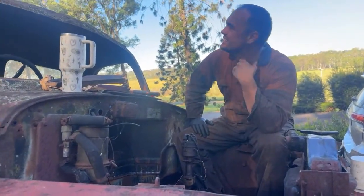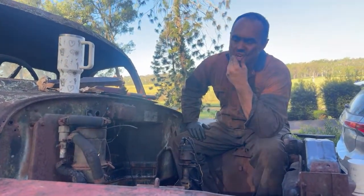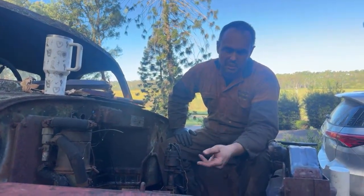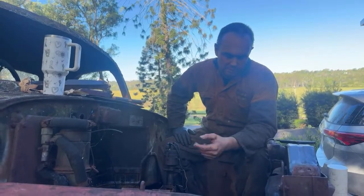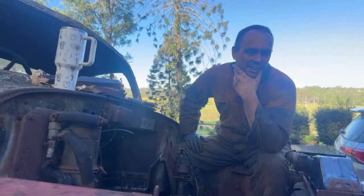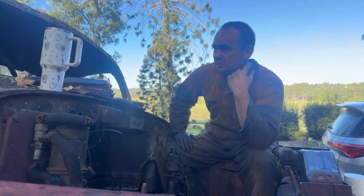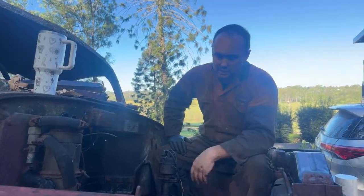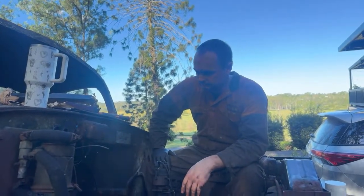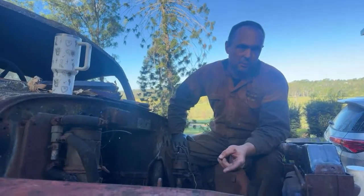The D10, I've rebuilt all the hydraulic control valves this week: the pilot valve, the blade control valve, the ripper valve, the pilot implement pressure valve, the pressure reducing valve. Put the transmission lube valve in it yesterday morning when we went to work. There's no real progress, but there's a lot of progress, you just can't see it. Pulled the transmission pump off yesterday before we came home. The new one will go back on in the morning.